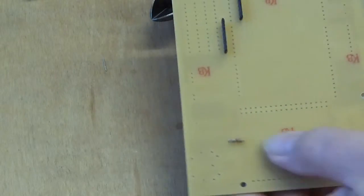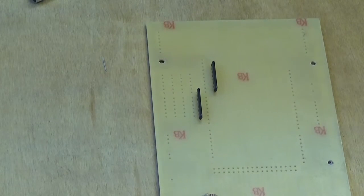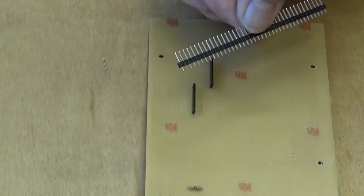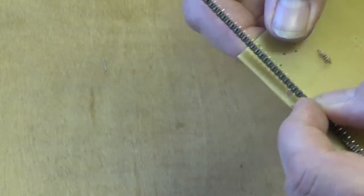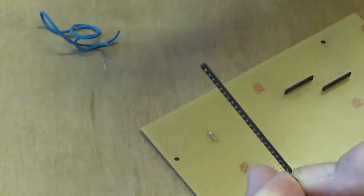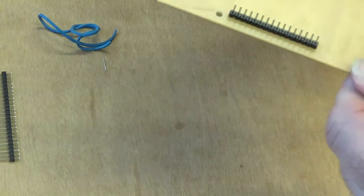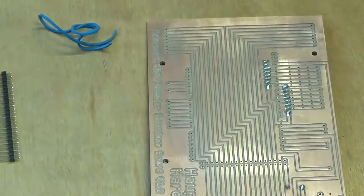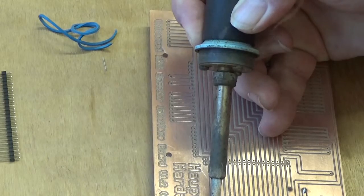That's the resistors connected to our board — the single resistor and two resistor packs. The next thing is to put the header pins onto the board. These come in long strips and need to be snapped off at the right length to fit. We pop one into where it's going to go, find the end, and snap it off at the little notch between the pins. That's now the right length to fit that section of holes. We flip the board over and use the weight of the board to hold the pins down, then just put a little tack of solder on one end to hold the pins in place.